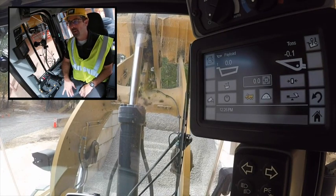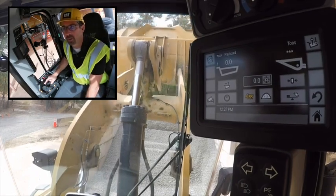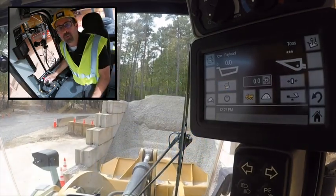That signifies that you went through the weigh range. There's your green box — press the bucket zero button, and you will get a message saying 'zero accepted, new zero point set.' That is telling the system that you have now zeroed out the system, it's ready to work, and you can basically get to moving production for the day.